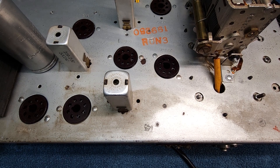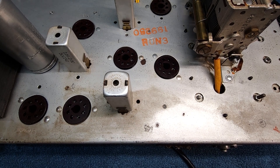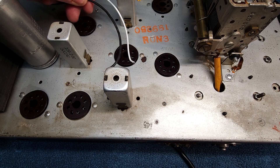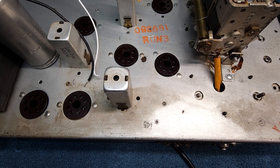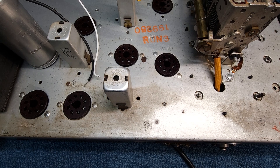It has the right proper size grommet for doing that, although you do have to poke a hole in the center of it — it has a skin on it. I replaced the white speaker wire we spoke about. A word on that: please ensure you're using the right wire, the right voltage rating. The wire I buy has a silicone jacket so it's very heat tolerant. Even though there's not 600 volts flowing to the speaker, it keeps in key with the radio. Silicone jacket means if something gets warm it's not going to get burnt. So that's done.